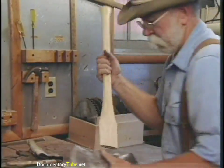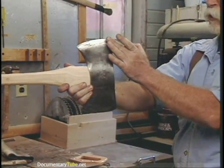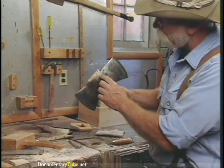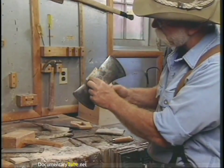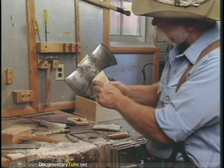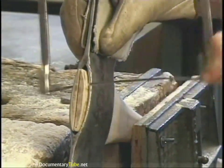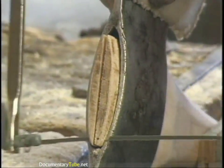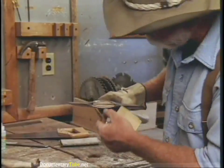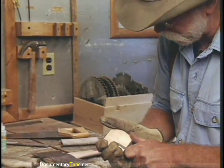Time to try it again. Put it back on. It would be a good time to sight down it — looks like the edge is in line, so it's going on square. Now that we've driven the handle all the way home, the edge is a little bit higher on one side. We just cut this off rough — the important thing is that it's square and the edge is in line with the handle. Take the coping saw again, follow the contour. Be careful at this point so you don't break it. And there it's trimmed off perfectly flush. The edge is pretty thin and doesn't have much for expansion, so I'm taking some of the thickness out to get the wedge down a little further.